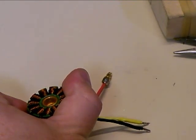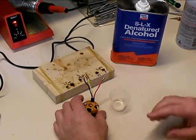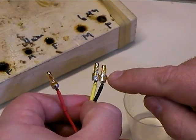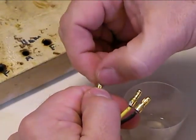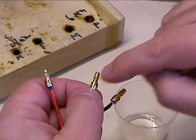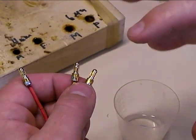I'll go ahead and solder the other two bullet connectors on the same way. Now we've got all three bullet connectors soldered on. One of the most important steps that most people neglect is to clean the bullet connectors off. If you zoom in, you can see some flux — the flux will drip out the little hole in the side of the bullet connector and ooze out, sometimes dripping down into the spring finger contacts. When you're done, the spring finger contacts should spin freely — that one spins free, but this one won't turn. The reason is that some flux got in between the little spring fingers and the center post of the bullet connector. If you leave that in there, you can get a complete loss of electrical contact and it just will not pass electricity.